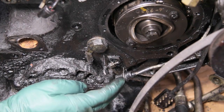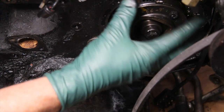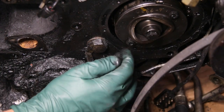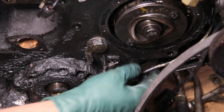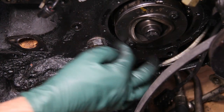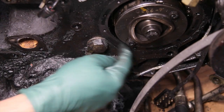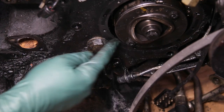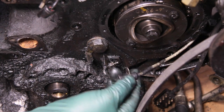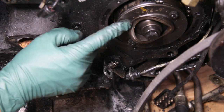So what did we learn? If you can remove the vacuum pump from the engine, you don't have to remove the pulleys, but with the vacuum pump off you'll have pretty good access to remove this end of the sensor wire. If you don't want to remove the vacuum pump — though if you have a leak and need to replace the gasket it might be a good time — let me show you a way to get to that nut without removing the pump.